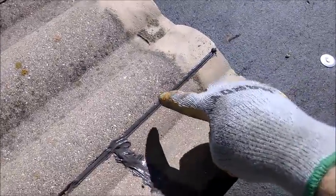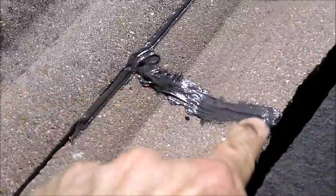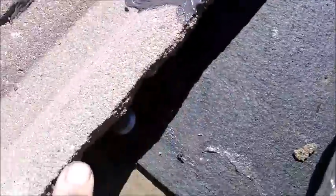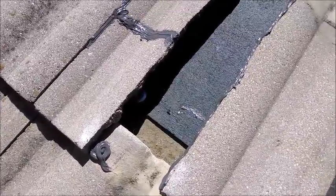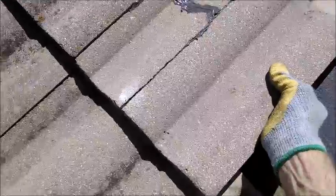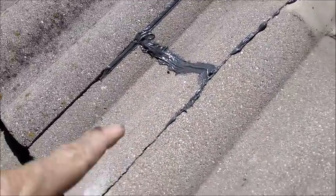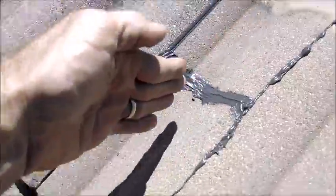Here you can see I have glued this seam shut and then sealed it down past the break area. I've glued that tile together across there, put a small dollop of adhesive down here, and pre-glued this crack as it mates up against this one as I'm putting this tile back together. You may be wondering how important it is to flash a tile after you glue it back together - it depends on the circumstance. A vertical crack like this is not nearly as vulnerable to leaking in the future as a horizontal crack that goes perpendicular across the flow of water in a heavy rain.